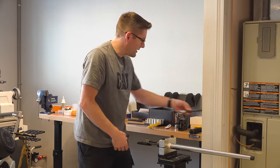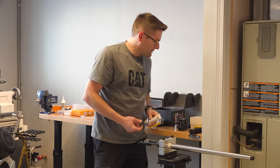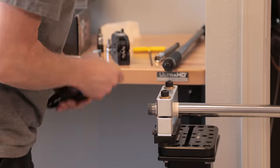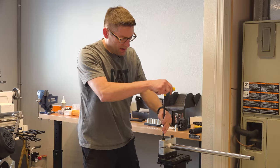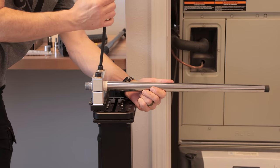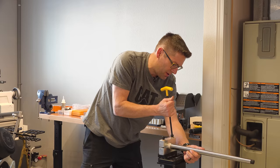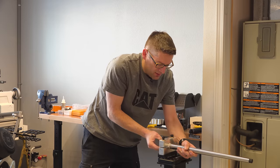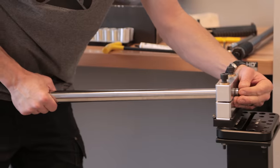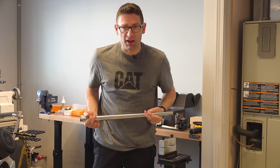That is a pretty simple way to do things. As a side note, I really like this TW25B lubricant — this is heavy-duty grease that was recommended to me by BAT Machine. Stuff works really really good. We've got our action, we can now loosen our clamping bolts here for the top block. I like to support the barrel and give it a little spin. This particular barrel vise has springs on it that lift the top block up, which I think is really nice. Now we can just guide everything through as a unit — boom — we've got our barrel ready for swapping.